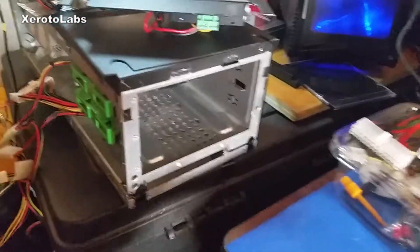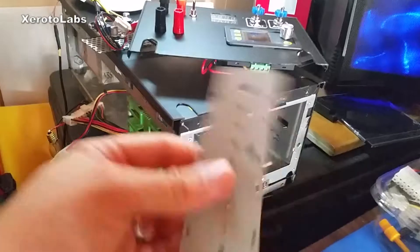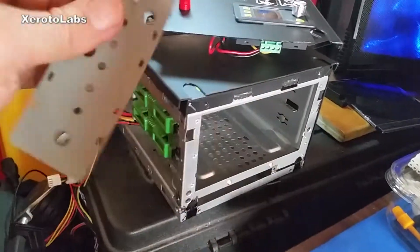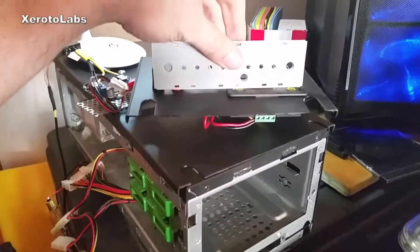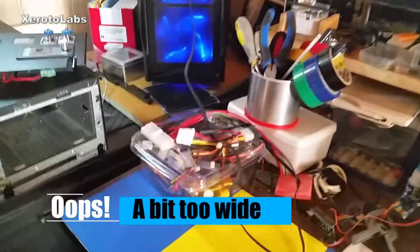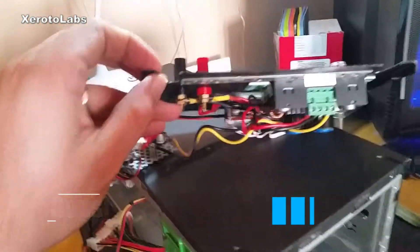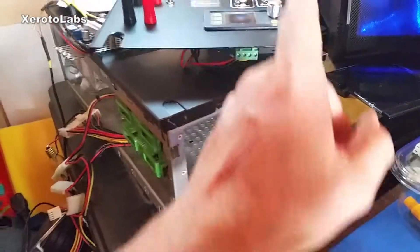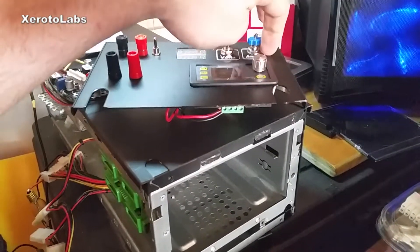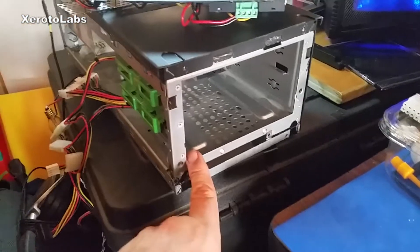I went from the exact edge to the center, so this being equal to the width of an opening of a bay — which I was using for measuring — you might see the problem here. The binding posts under here don't allow for the space between the edge of this module and this outside trim pot. These binding posts for the ground are too far over by about a quarter of an inch.